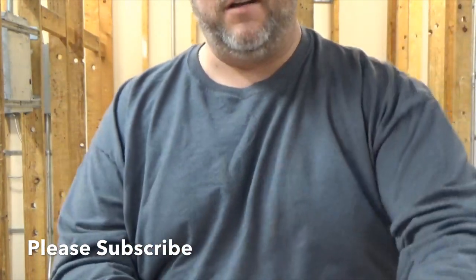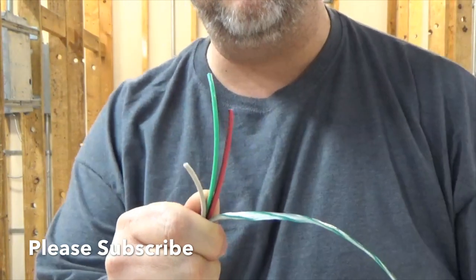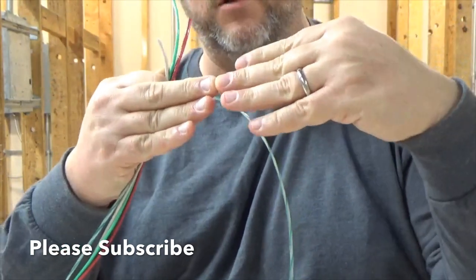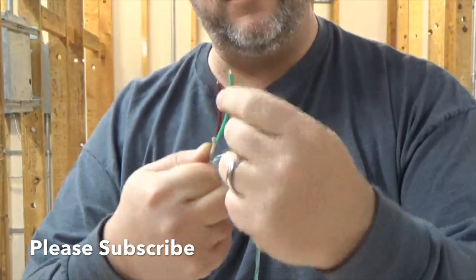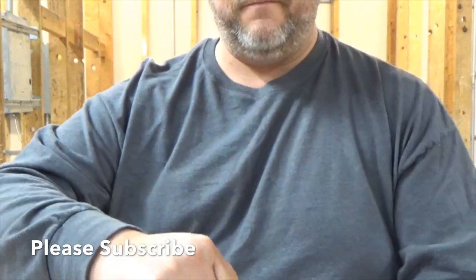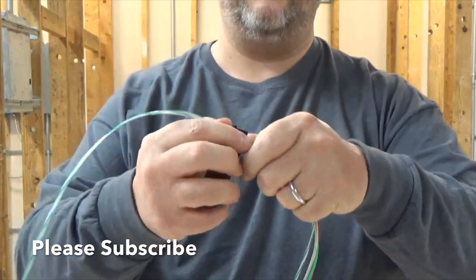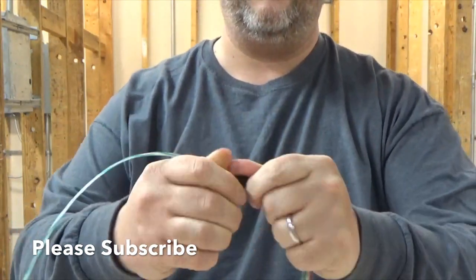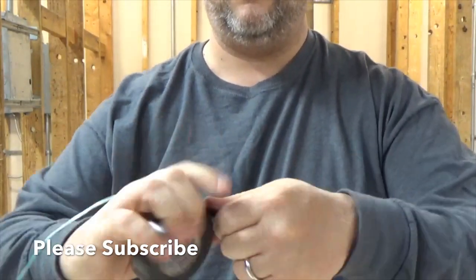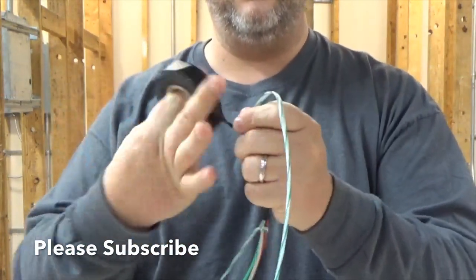I'm gonna tape the head so that these little pieces of THHN don't get stuck on any part of our pipe. If the connector coupling is not completely lined up and it's a little bit off, leaving these open ends will get caught on the wire. So I'm gonna take my tape again and tape it — tape my wire up. Leave an end, make a friend.